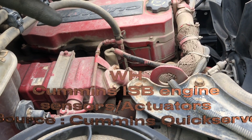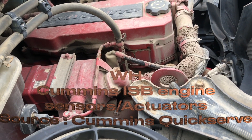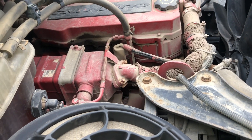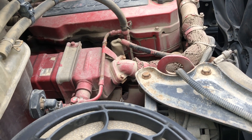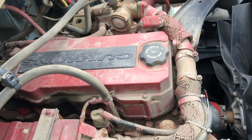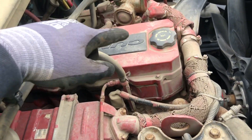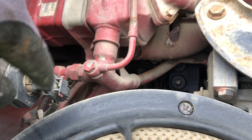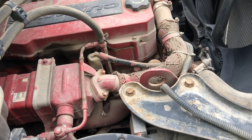Hello YouTube and welcome. This is a Cummins ISB 6.7 and we're going to go through all the emission systems — it should be similar to the ISM and the IS-6. By the end of this video you'll have a good understanding of their functioning and location. The intake on this motor is on that side, and the exhaust — as you can see — the turbo and exhaust are on the right side, looking from the back like you're sitting in the driver's seat.